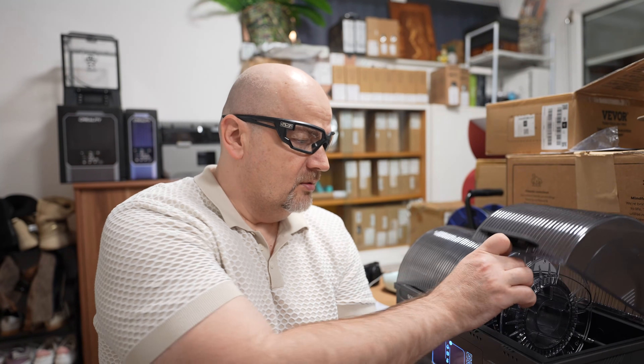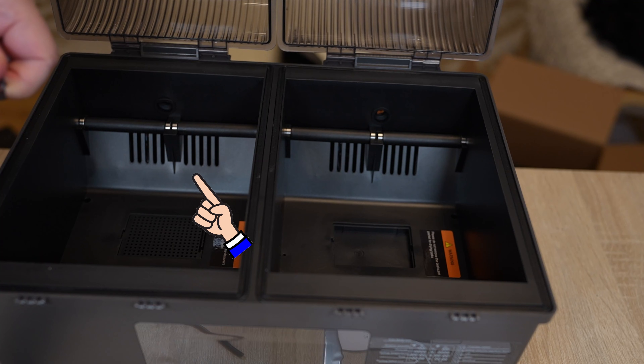Overall I like the dryer. The hot air at 85 degrees Celsius is accurate and it's relatively quiet. I can also rotate the spool with one hand in just two seconds. Only two things I don't like: the distance between rollers should be a little bit smaller, and maximal hot air only reaches the center — so if drying two spools at once, the inner spool will dry better than the outer. And a question for you: was this review too complex? Maybe I should just dry the filament, print, and show the results simply. Anyway, thank you for watching and happy drying and printing!